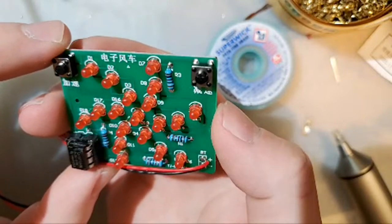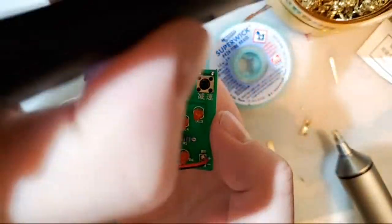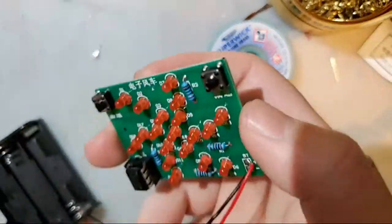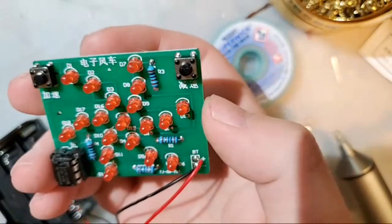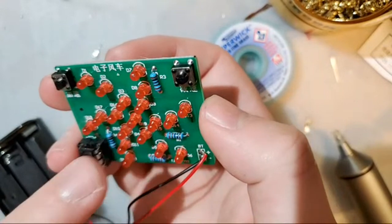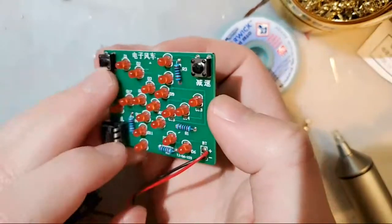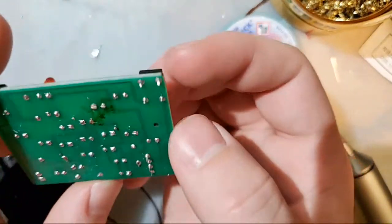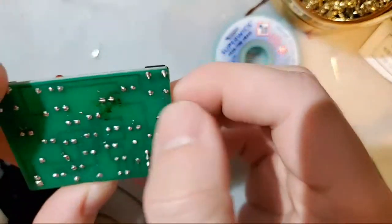Now, there is one more thing that I want to discuss, and I can't really get into repair at this moment, but let's say you lift a trace because you're not familiar with soldering, your iron's running too hot, whatever it is, you end up lifting a trace. How you can tell you've lifted a trace is because you can't get solder to stick to it anymore.